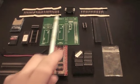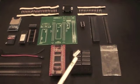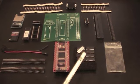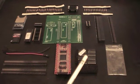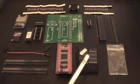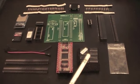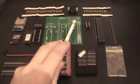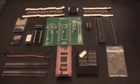We have a chip over here which is actually put in this socket, which is an inverter chip. Signals come out of the GODIL, they are put through the inverter chip not because I need the signals inverting, but just to clean them up a bit. After they've come out of the GODIL they will be of varying degrees of high or low depending on whether they've been switched recently to high or low. The inverter chip pulls the signals higher quicker or lower quicker. These signals are then put through some resistors and out through a VGA connector. This is what the 80 column card is generated using.